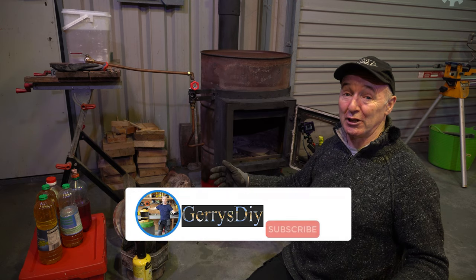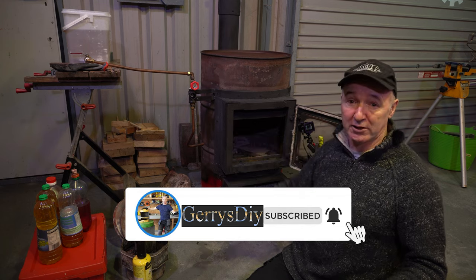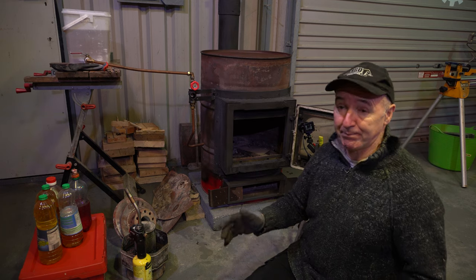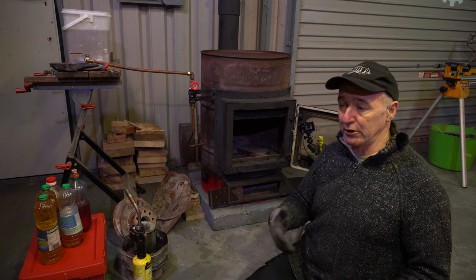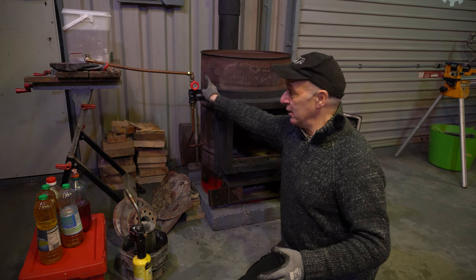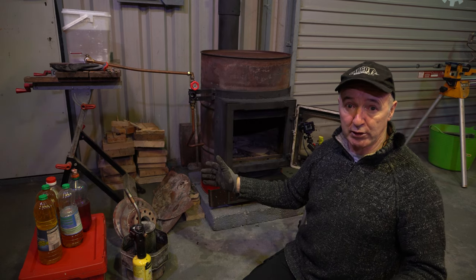I made this stove myself out of an oil drum. I welded a frame with some plate steel and some box iron, some bits and pieces I had around the place, and then I stuck a cast iron door on it. It's a fantastic stove - I made it for multi-fuel. Initially I was running it just as a stove, but it will burn waste oil. To make it burn waste oil, what I had to add was a drip feed system, and it works really, really well.